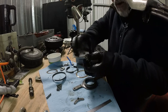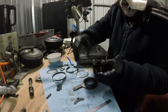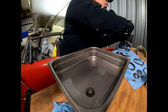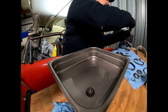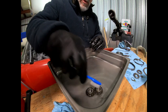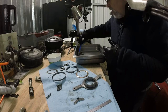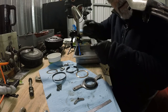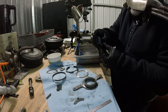So what I like to do with my bearings is I get them wet first with solvent. When I get the majority of that stuff out of the little crevices, you can see where the rollers go. Just want to get some of that grease out of there, get it loosened up, and then it goes back into the tank where it can sit. But getting it started with that initial, getting the bearing race to kind of spin around a little bit, is very helpful in getting a lot of that grease out of there.